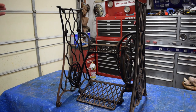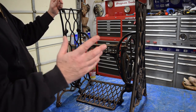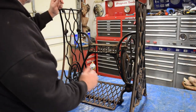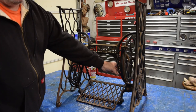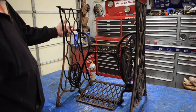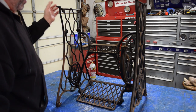Okay, it's time to disassemble this base. It's basically modular, very much like the cabinet was. These two side pieces are bolted on. This is a very early machine. It actually has a wooden pitman arm. I think the owner told me this was from 1905. In later machines, there's different hardware that mounts these, but it's all the same.